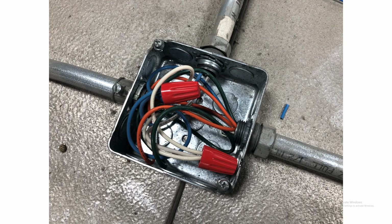Now, when I cut the live with the cooler, I didn't know what breaker was what. The managers run around, and I just wanted to cut off the power to the inside. I didn't want to cut off the condenser because the cooler would get hot. So I cut it off here, cut it live. I had electrician's gloves on, and I was not grounded. I was up on a plastic ladder, and I cut it. No problem. No sparks, no arcs, shocks. It was fine. I've done it before.